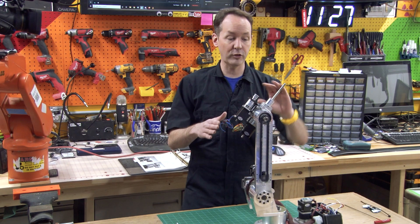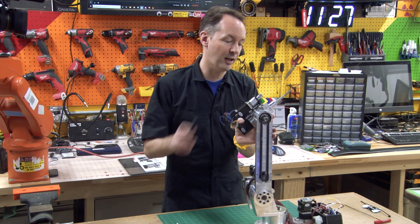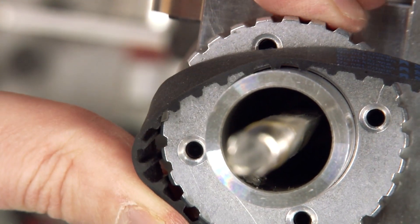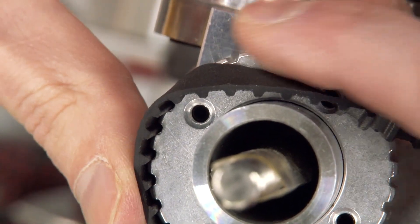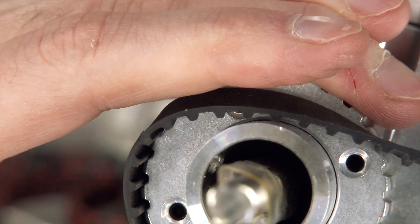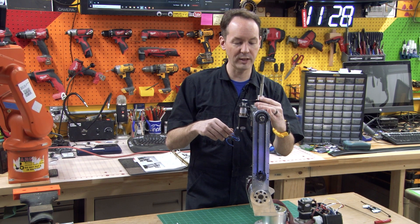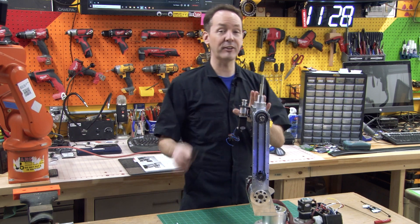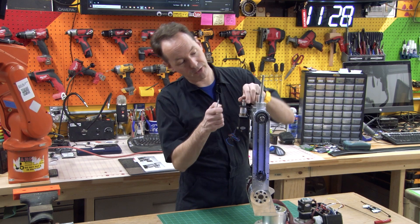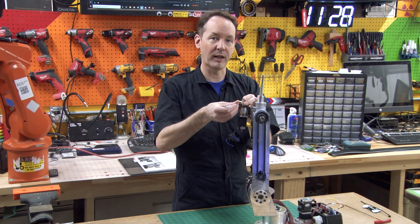You've got to get this right. So I'm going to take all of this apart real quick and put it back to air. Let's see how close I am — I'm really close, painfully close, but I don't want to leave that together because I'll stress the motor and gearbox. So I'm going to take out one shim, because I added three from the first time. The first time I had three and it was super loose, so I added three more. I think what I need to do is take one out. We'll just time-lapse this.